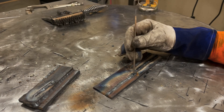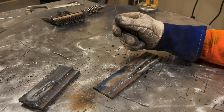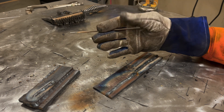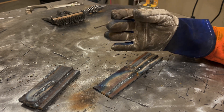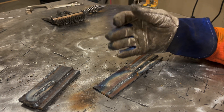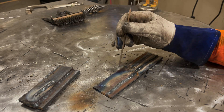In this footage the trailing edge is definitely eye-shaped. I find that 6013 tends to round off a little bit more rather than coming to a point, but it's very distinct here, and that's one of the reasons why I like welding with 7018 over 6013 - it's just a lot easier to see what's going on. Every rod has a different molten puddle; some are more easy to see than others. 7024 is very tough to read the puddle because so much of it's molten it's almost indistinguishable. 6013 is a little better, 7018 very easy, 6010 also very easy to see.